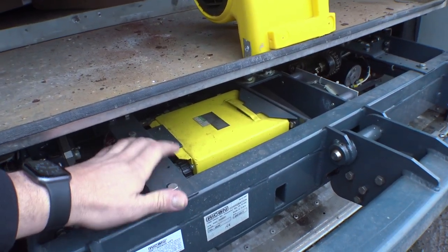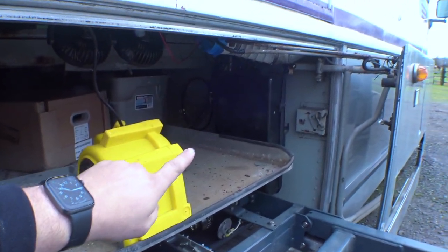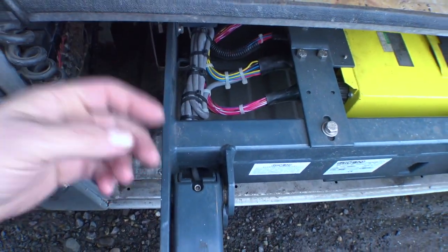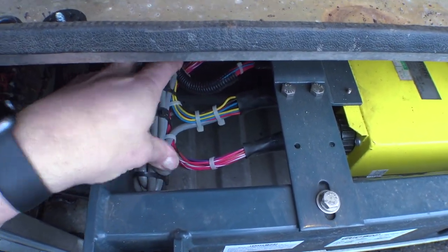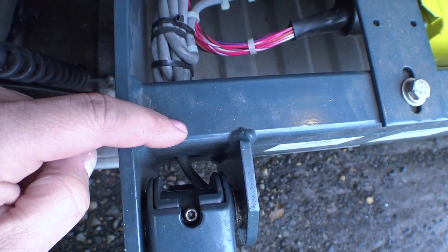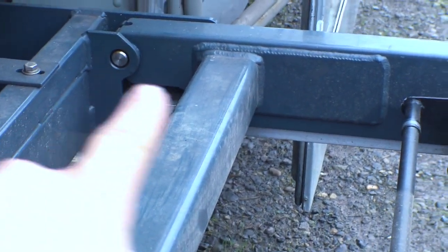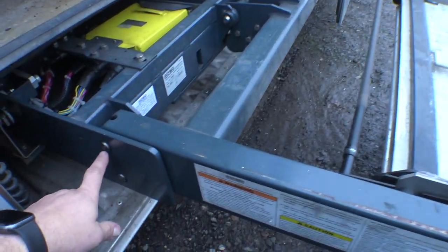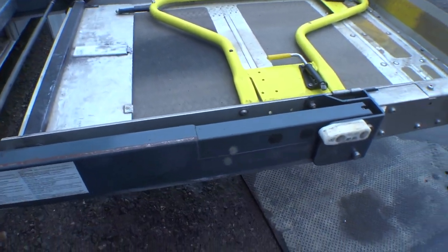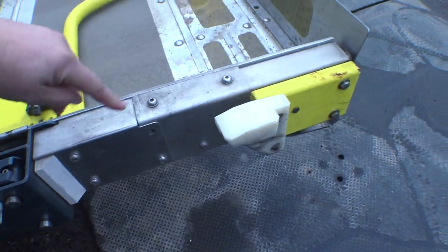Our main carriage sub-control box is here — this is what controls everything on the carriage. There are a couple of motors to go in and out, and it sends a signal over to the main controller box that houses the hydraulic pump and everything. We've got a lot of wires that come out here. I've sat right here and run the lift up and down, and when it stops, I poke at this little bit of wiring and it'll make it stop or start again. The way this lift works is there are two arms on each side on a pivot that cross-slide inside this mechanism, and that wire basically goes between those two. It comes up and out right here into this little box, and over here we've got some limit switches.